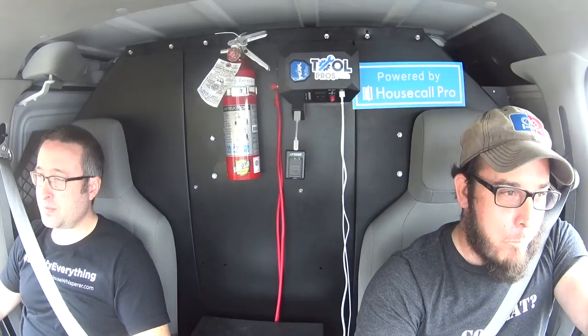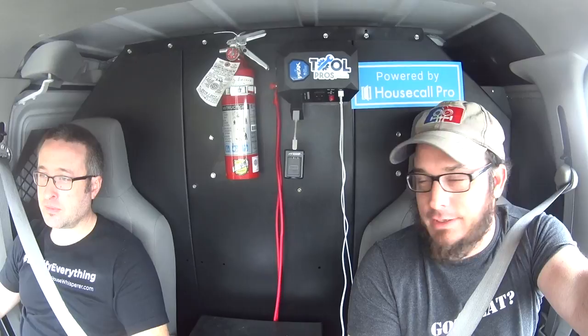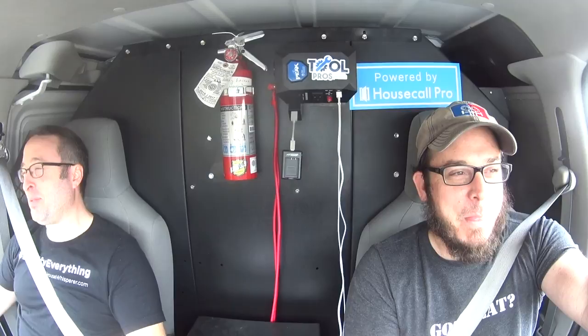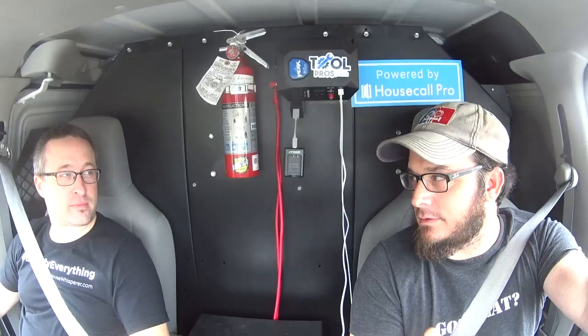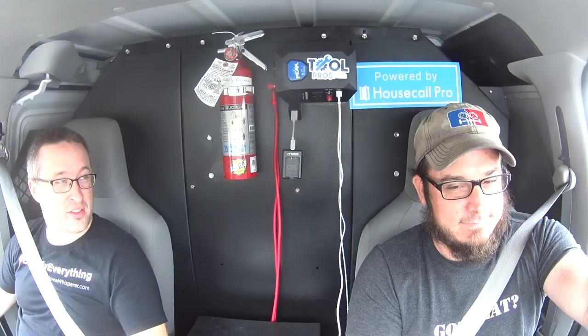We've had a good time today because Nate is from Ohio, and in Ohio, duct leakage is basically a non-issue. For the most part, homes in Ohio have ducting inside the perceived envelope of the house. Perceived is definitely a good way to put it. If there's sheetrock on the wall, people think that it's inside the envelope. Usually it's in the basements, and then inside walls is where most of the ducts are run in northern climates.